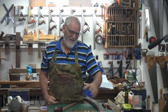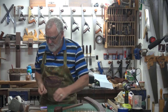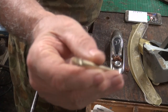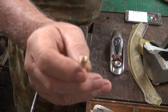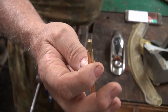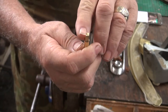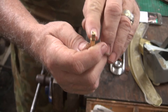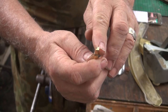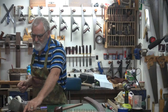Yeah. So I've got some milling to do. These harp tuning pins that I've just made. This square drive at the top, this one's 5 mil, but I'm doing them now at 6 mil. But it's about 0.5 mil difference. So this section might be 5 mil. This section is 4.7 or 4.5. Couldn't figure what it was.